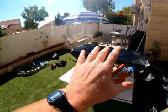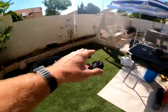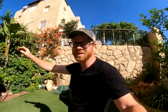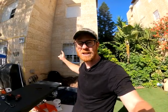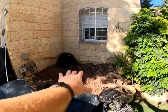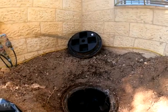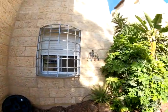Check out this job. We came back here a while ago — the building had a clog. There's a sewer over here, they knew about that sewer. We opened it up, went this way, unclogged it, and discovered a hidden manhole. They said there can't be a hidden manhole — we've been here for years, there's no manhole there, there's a tree over there. Well, there was a tree over there. I located it with my device and showed them with the camera. Sure enough, we dug and found a manhole with a tree on top — only the corner was exposed. They had to dig down about 40 centimeters and take off the big tree, and now you have access for future clogs.